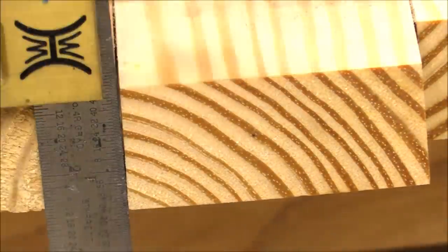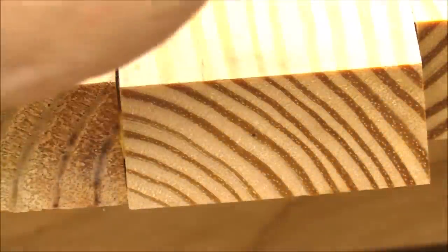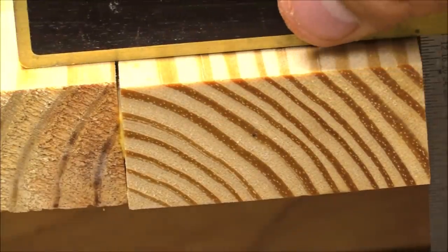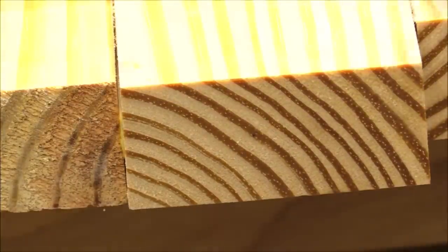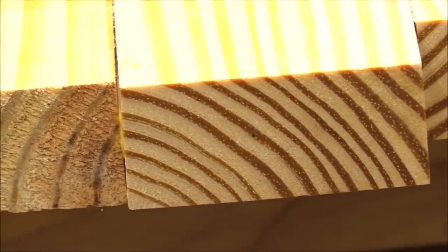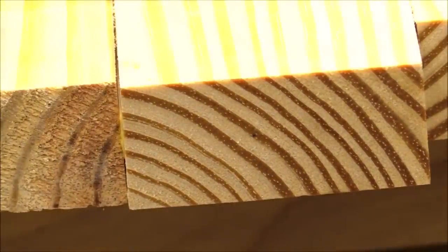Unfortunately I've got a little gap. I got ahead of myself — I squared up one side but didn't square up the other on these. So I've got a few that have little gaps; they're tight at the bottom and gapping at the top. I guess that means the clamp is doing its job. If I had done that with a regular clamp and really compressed it, it would have started warping the top. In this case it's kept everything perfectly flat across there, so that is a good thing.